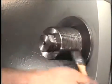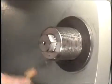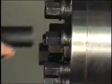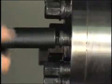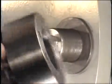Next, apply lubricant to the main thread. You may use either your standard lubricant or the Superbolt lubricant. For reinstallation, verify that the jack bolts have been freshly lubricated. Make sure the jack bolt tips are flush with the bottom of the nut and spin the tensioner onto your stud until it seats against the washer.